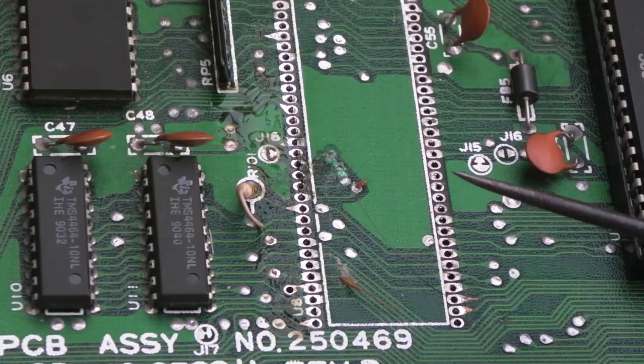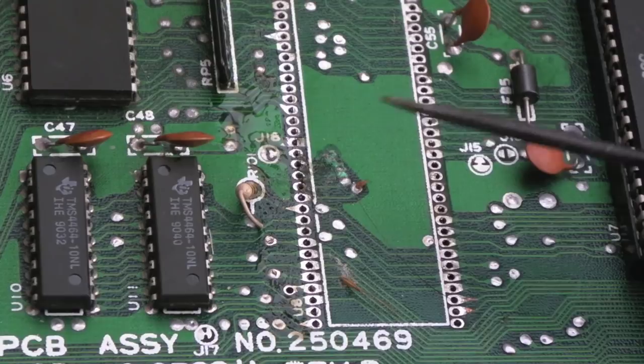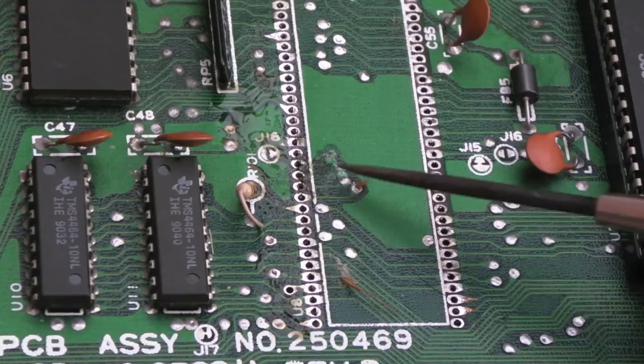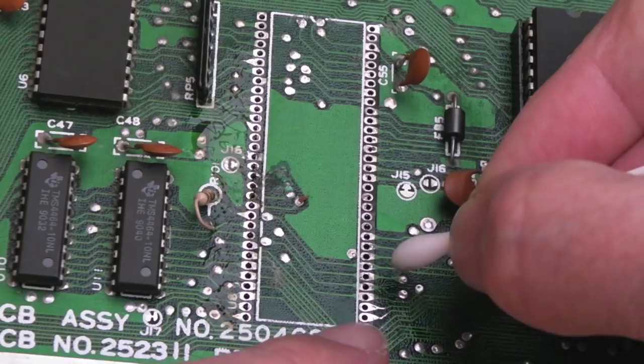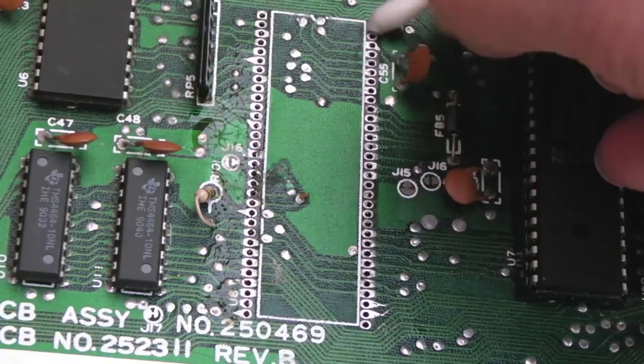It could be because of some of the corrosion on there. Also it's a bit colder in here at this time of year - the ambient room temperature affects the soldering. Winter months I do find it harder to solder. That's why if you go back a few videos to the CD32, I was having problems getting the caps off. Anyway, I'll clean this all up with some flux and desoldering braid, inspect this area more thoroughly, get a socket on there - I've got a couple of shrink DIP 64-pin sockets. I'll clean up the pins on the chip and just give it another try. I used desoldering braid with a bit of flux, just gently cleaning over here - don't want to snag any pads.